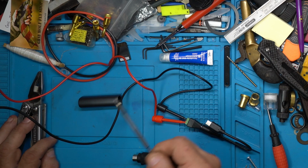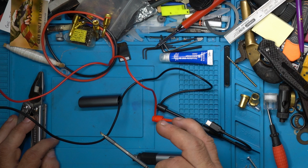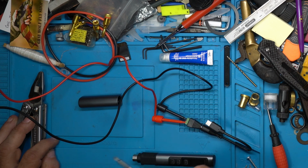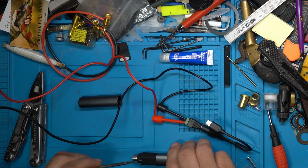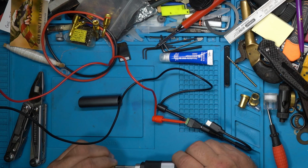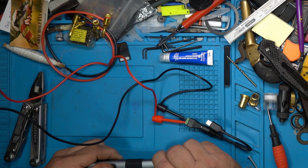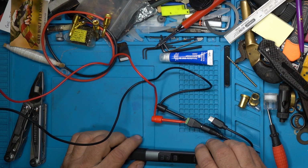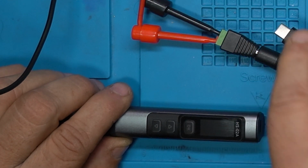I've got it set to 2.1 amps. We already know at 2 amps, it will reset the iron. So I've got it set to 2.1 amps now, which is really kind of bumming me out, because it's telling me my power supply is just barely putting out 2 amps when it should be able to put out 3 amps. Well, my cheapy power supply. Thought I'd found a decent one. Now, also another thing to think about. Well, let me just talk about that in the final thoughts.